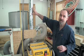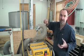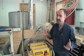I drove long Tapcon screws through pre-drilled holes in the wood into the actual metal of the pipe. It's another reason why using spiral pipe makes so much sense, because the wall thickness of this pipe is thick enough that it can hold a screw like this, whereas regular heating and ventilation duct is far too thin to do something like that.